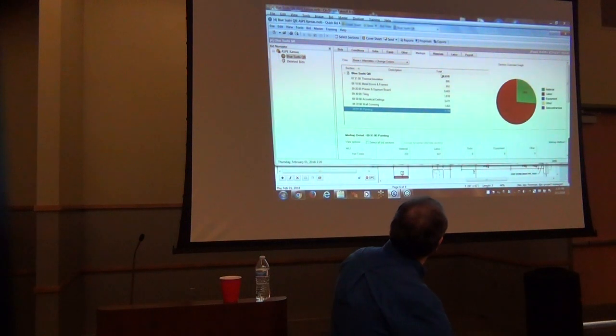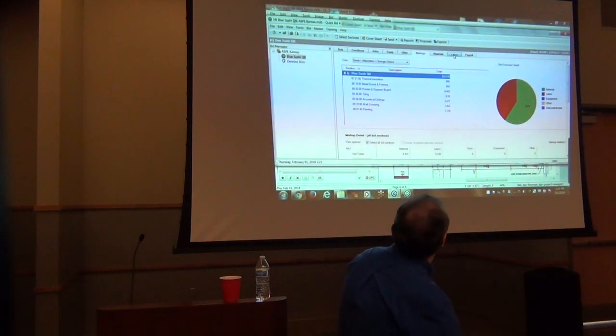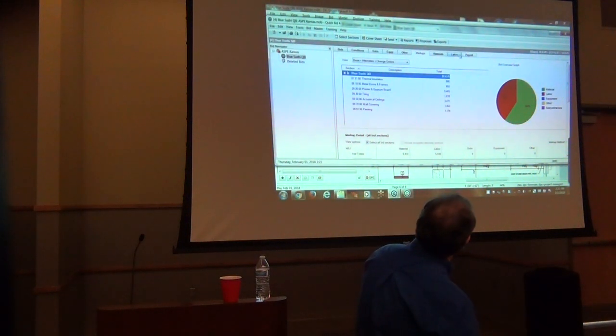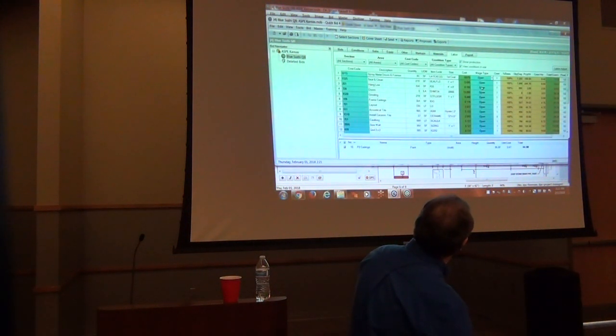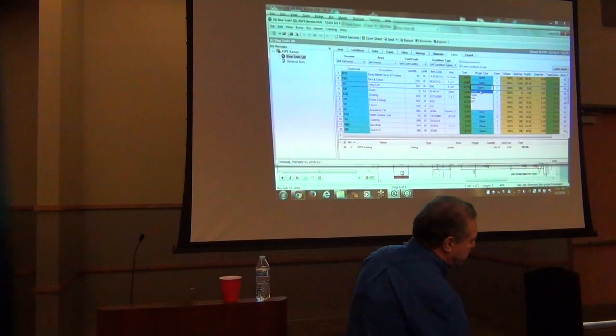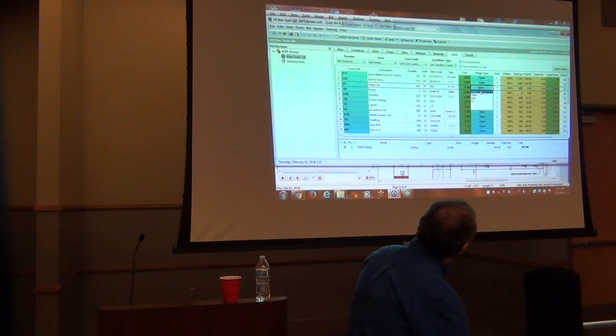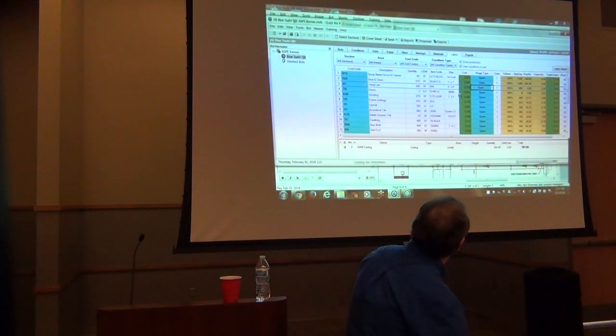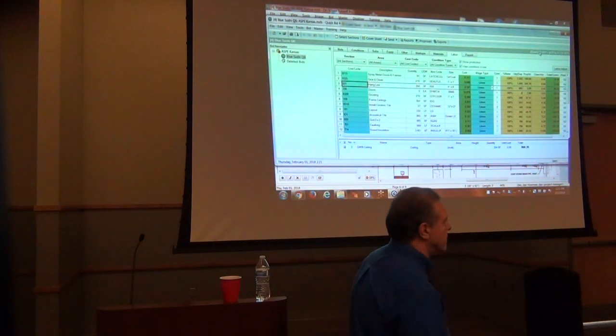Now, Quick Bid sees this job worth $18,000. I'm in an open wage. Is Kansas open or union? Open. If for some reason I needed to switch this to something else, prevailing, Davis-Bacon, OSIP, you set the job up, you set the program up to where it has variables in here by pay rate. I'm going to right-click and watch the total. I'm going to switch this $18,000 job out to union. And we're at $21,000, simply because of the wages and the burden.